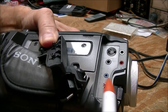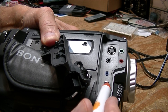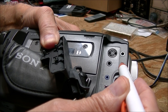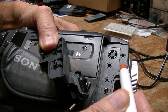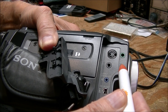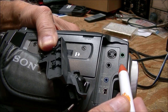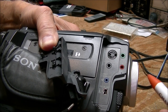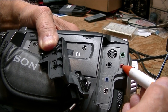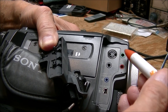There's the FireWire, or what they call the i.LINK. Here's a microphone input — a powered mic input. From what I understand you probably couldn't use a regular dynamic mic; it probably has to be a condenser mic, which would require 5 volts to power it. So I think you need a condenser — in other words, like a computer mic that plugs into a stereo eighth-inch jack. And there's also your headphone output and S-video.